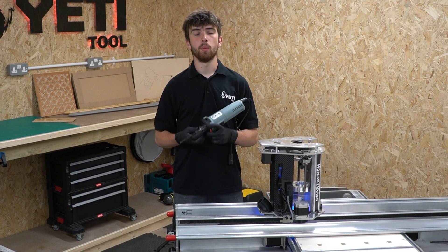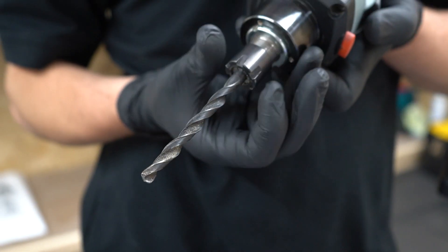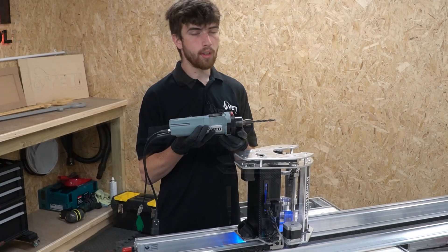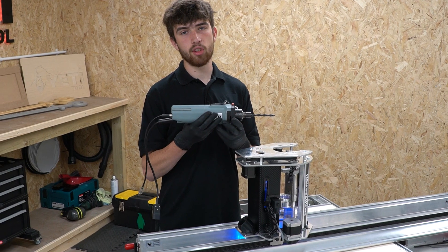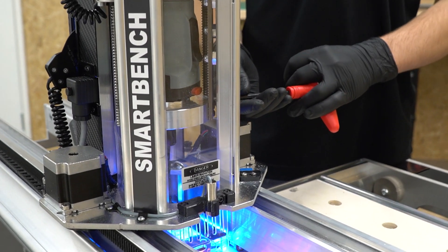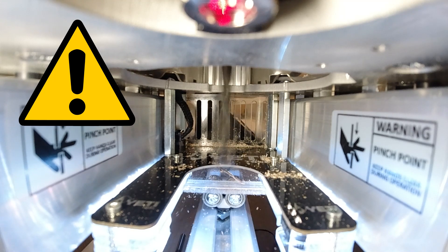To illustrate this we're going to do something that you should never do — we're going to put a drill bit in the spindle motor. This is dangerous because drill bits are not perfectly balanced for the speed that the spindle motor spins at. This means when it gets up to speed the drill bit will resonate and start to deflect and could possibly break. They're also long and weak in the body. As you can see here, the drill bit deflects by a dangerous amount. We didn't even get up to full speed — we shut it off early because anymore and there's a danger that the drill bit could break.